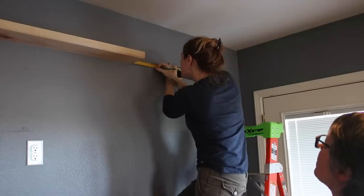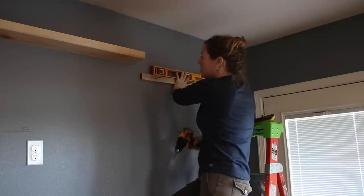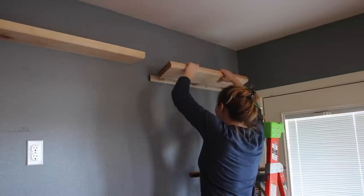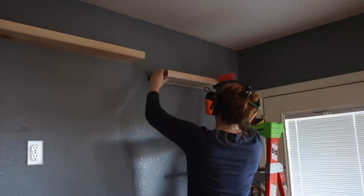Before hanging my crazy conglomerate of shelving units, let me hang a simple single straight shelf to show you how easy the process can be. I measured where on the wall I want the shelf, used a stud finder to locate the studs, then transferred their location to the ledger board. Using a level, I screwed the ledger board to the wall, then just slipped on the shelf. It's a tight fit, so I put in my ISOtunes and used a rubber mallet to seat it all the way.